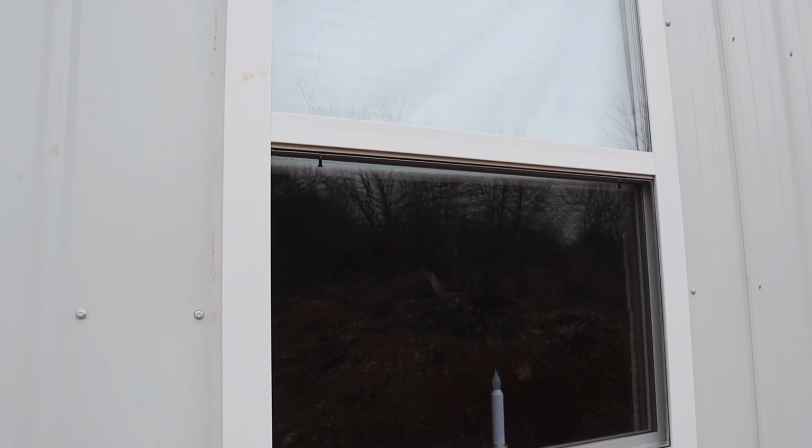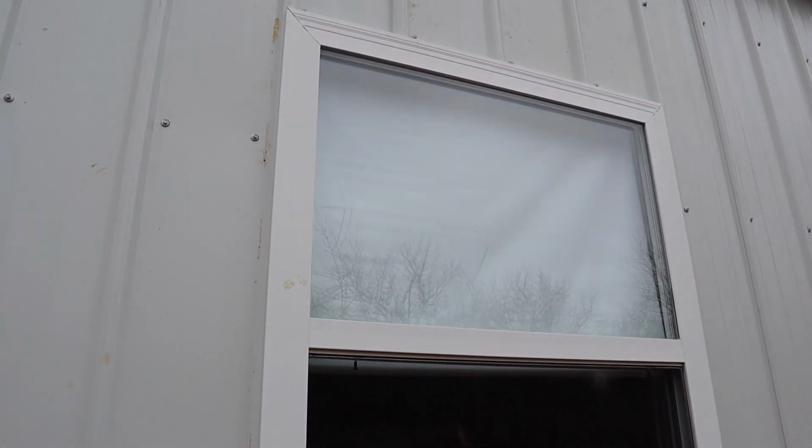The drywall, we decided not to finish the drywall. We put vapor barrier up behind the drywall. We probably will never go through and do any mudding because this will eventually be turned into a garage or another space. If we ever do decide, we can come back and finish it later on and paint it nice. At the time we were building, materials were already fairly high, and we were starting to see a shortage of different building materials. So the only thing we were really able to find were some of these vinyl single hung windows. They're insulated. They actually work really well.